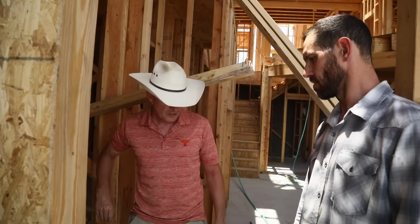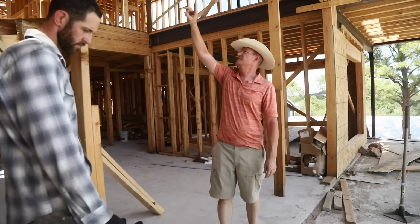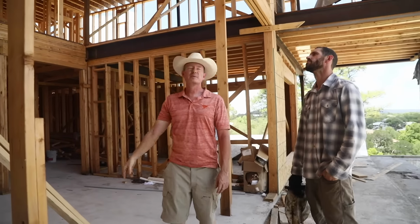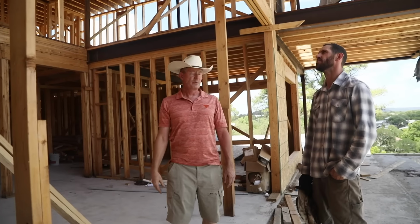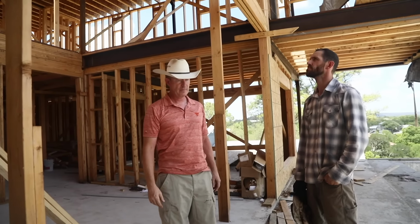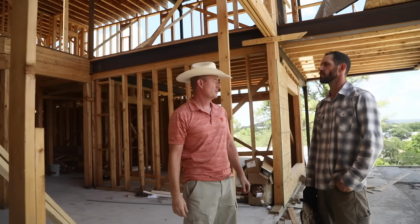Exterior walls, okay. So I may make this interior wall here, and if we have enough material, I may skin this entire wall with OSB. And then we'll put drywall over it. The reason I might do that is that it's another shear wall, and when you look in here, there are more allocations for shear connections that he drew on the plans.